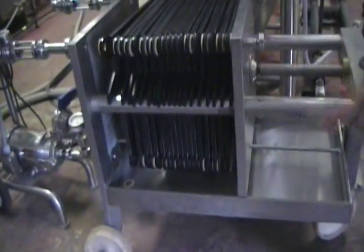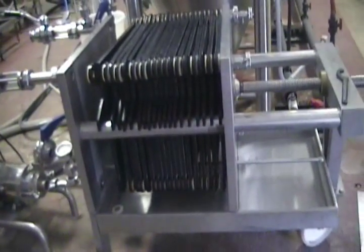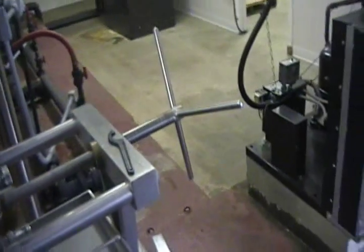Typically about an hour and a half maximum for 10 to 11 hectolitres, but it depends on your sugar content, the type of grain you're using, and when it was harvested. Those are things you're always having to adjust, as well as your hops. One variety of hops one week could be 6.8 percent alpha acids; the next shipment might come in at 5.2 percent. So you're always having to scale up or scale down accordingly.